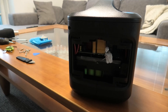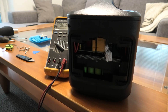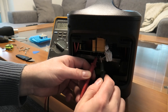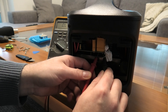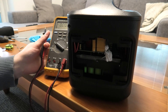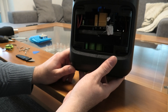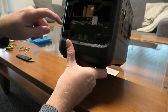Actually, to answer one of the questions I got — we can measure the battery voltage, what voltage comes out of the batteries. There's a lead there and a lead there, and there is 22.87 volts coming out of that. So that means it's configured in a 6S — so there are 6 cells in series. And that's probably 1, 2, 3, 4, 5, 6 cells here that way.